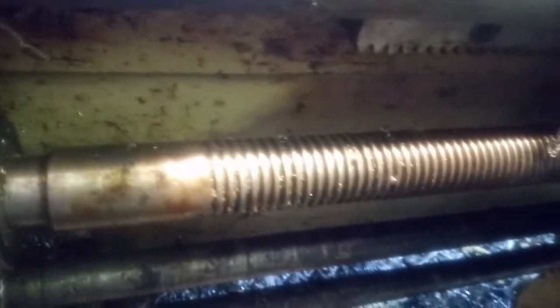Now, most lathes have a 4 for big lathes, or an 8 teeth per inch lead screw. The feed screw is different. It just drives the cutter, and it drives it through a set of gears, and it's not precise, but the lead screw is very precise. So if you're cutting 8 teeth per inch, you'd connect the lead screw to revolve at the same speed as the headstock, as the work.